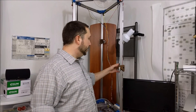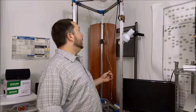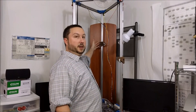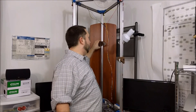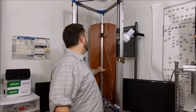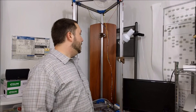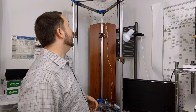Moving up to these — they're called the trucks or the carriages. The motors turn these belts which then move the carriages up and down. I came up with a design I call the big wheel, which has two small wheels and one large wheel, and together they're really solid and stable — not wiggling at all. I also designed my own mounting points for the belt. These trucks are 100% my own design, made in OpenSCAD, so they're parametric and I can customize and rebuild them easily.